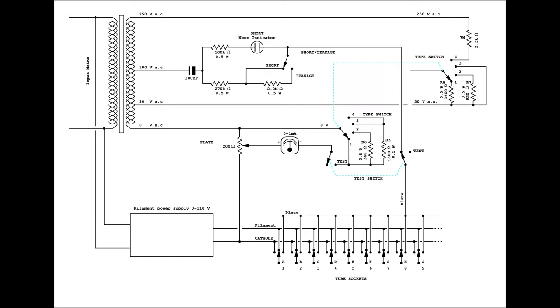Using a separate power supply to power up the filaments would remove the need to make a line alignment while powering up the tube tester, and, more importantly, it would let more freedom in specifying the filament voltage. If it is a current-limited power supply, it could also be possible to specify the maximum current, according to the tube specifications, reducing the space for destructive mistakes.